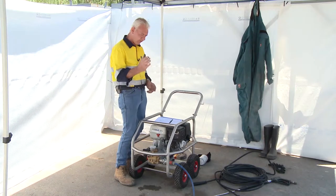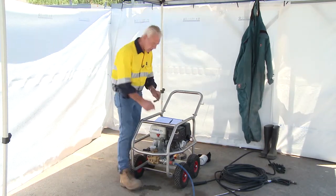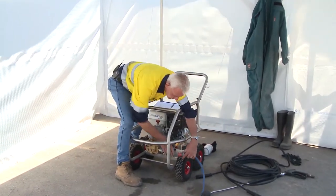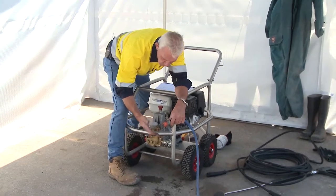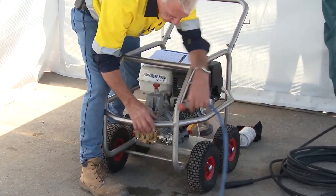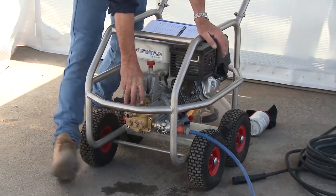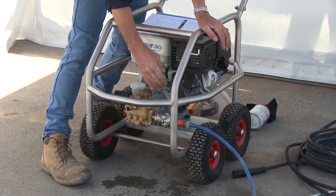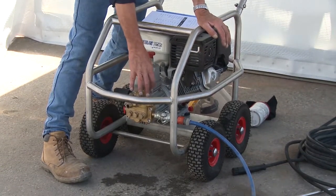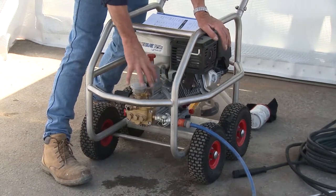The way we set this one up, we put a pre-filter on the tap and then run the hose through. Before actuating the pump, run the water and ensure it is clean and the filter is not impeding the water flow, because these pumps cannot run dry. If they run out of water, it's detrimental to the seals, pistons, and valves contained within the pump.